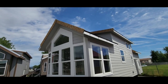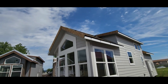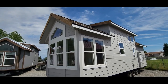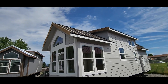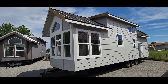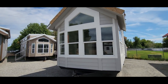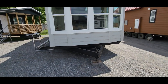I get a lot of people asking me about what's up on the roof — it looks like plywood, and it actually is. It's a windbreak to keep the wind off the shingles during transport so we don't lose half the shingles. Once the setup company comes in, they'll remove it, fill it with caulking, repaint it, and you can't even tell they were there. It just makes things easier and a smoother process.